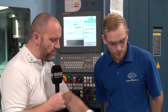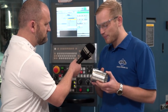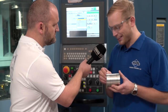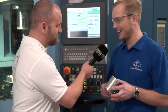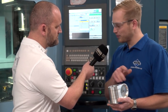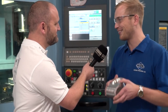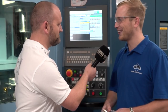And I know this part here you use the anti-collision for, so can you talk us through it? This part here, with our holding system — the Lang vices — you can hold on 3mm, and this part actually measures 3.25mm. So we are really getting to the limits of what we can do. When you are going 3-axis machining, you can kind of predict where things are going to go. But when you start swinging axes around and moving about, the collision detection is vital to make sure you don't hit your machine.